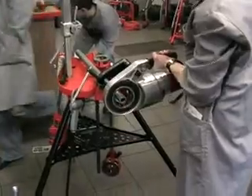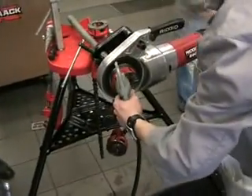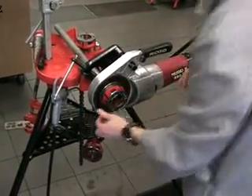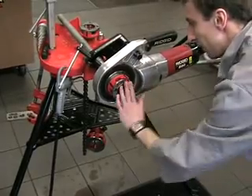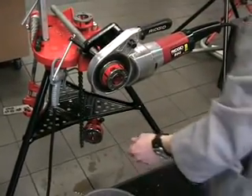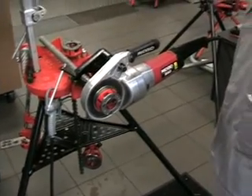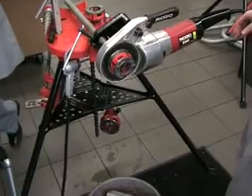Now this is harder for the machine because we are making a straight thread — you are always going the same depth. With the conical thread at the end you are opening and that is easier for the machine. This is also the reason we say this machine is ideal for plumbers, perfect — but if you have heavy duty intensive 2-inch or big industry use, you have to recommend the 700 machine. That will do every minute of the day a 2-inch thread without a problem. This machine is limited to parallel thread maximum 1 inch and a quarter.